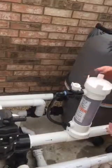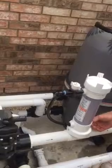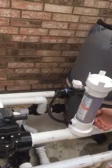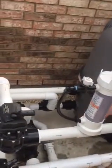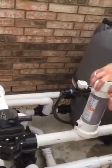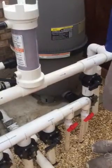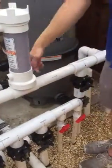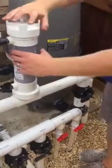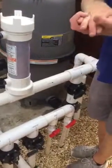But what this does is when the water flows up through here, you've got a check valve on the bottom of here. And when the water runs through, that check valve is supposed to keep that water from coming up through the bottom. Oh, okay. And it actually goes through this tube and then runs through this, and that's what controls the chlorine. Once you put this lid back on and the water finally fills up, it builds pressure and pushes that ball back down, allowing the chlorine to flow through into the pool. Okay, got it. And so I always just prime it up so that it gives it full pressure. Gotcha.